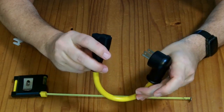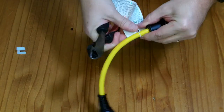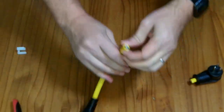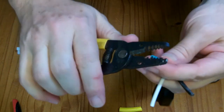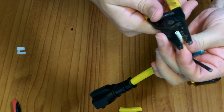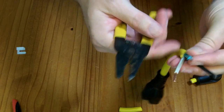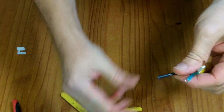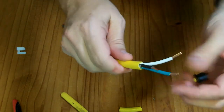All in all it looks pretty high quality, though the only way to tell for sure is to look inside the cable. Those certainly look like they're 12 gauge. I'll start with a 10 gauge — nothing popped off there. Let's go to 12 gauge — nothing came out of there, so that does look like 12 gauge. Let me just hit 14 to see — yep, it's definitely bigger than 14 because I got a couple of little pieces of copper. So yeah, that looks like quality cable, the right size.